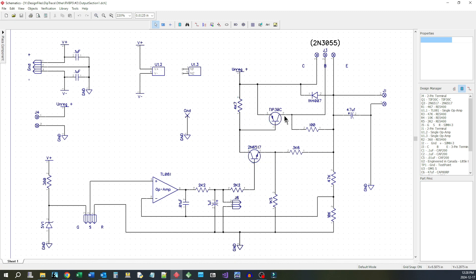This NPN transistor is going to turn on this PNP transistor. The PNP has to be able to stand the full unregulated voltage, and this has to be able to stand the voltage difference between the input and output — same with the big 2N3055 up here, which is going to be the pass transistor. The reason it's on a connector is because it's going to be off-board on a heatsink. This resistor gives a little bit of negative feedback going into the emitter of the transistor, and we put in this resistor here to provide a little bias to keep things stable at low output voltages. A 47µF capacitor on the output — all of those are for stability purposes so this thing doesn't turn into a high-powered oscillator.